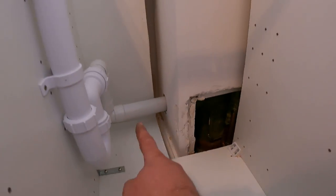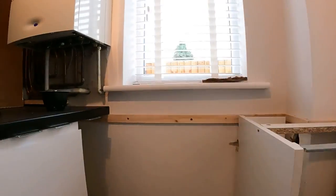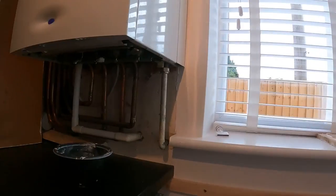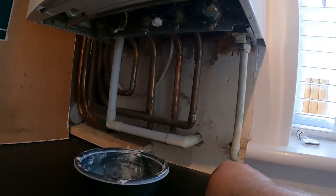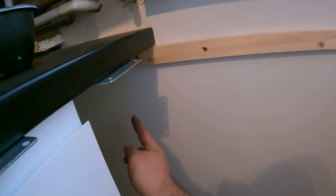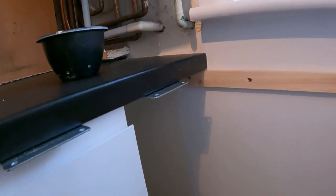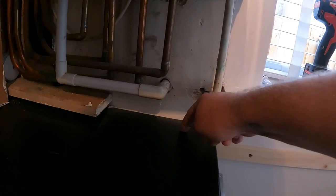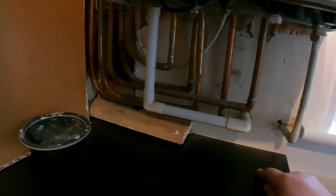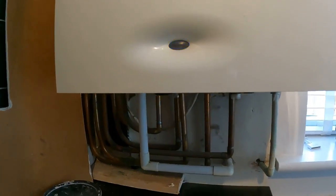We've managed to go onto that bung in there — brought the inch and a half out, we've got our standpipe there. I've just drilled a hole through the back ready to put the wastepipe. So now we'll just connect onto here. This is your cold, so we'll turn the water off, cut a tee into here, drop down through the worktop here, and we'll just have a little washing machine valve tucked underneath there — nice and accessible when they pull the washing machine out. So let's go and turn the mains off. We'll drill a hole through there ready to take the cold feed. This cover goes down the side of that box and covers all this anyway, so you're not going to see it.